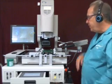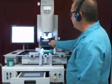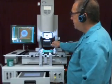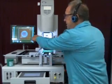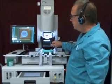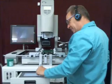So to start, I've already had my board in the fixture. We're just going to pull out our vision system. We want to make sure that our component is lined up inside the pickup tube. You can see our pickup tube is in blue here and the component is right on center. So we'll close the camera and press our pickup command.